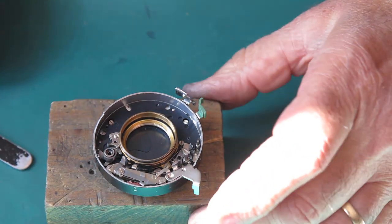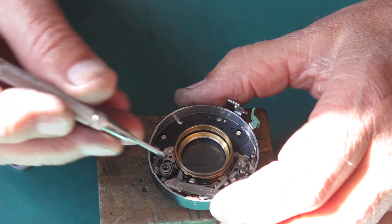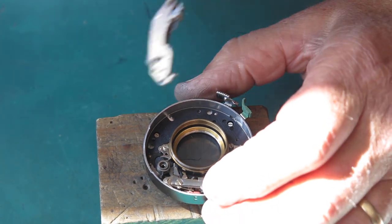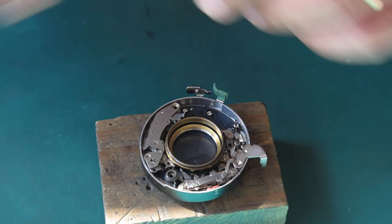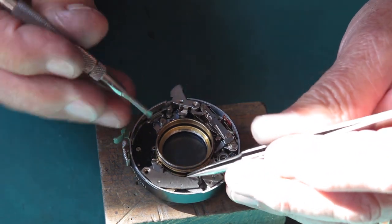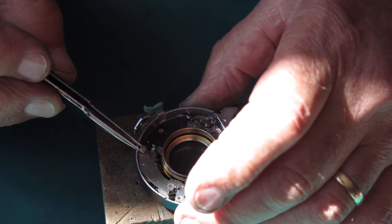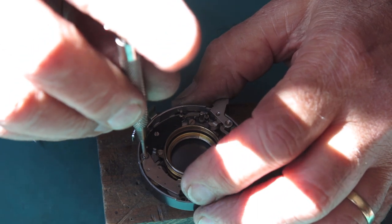That's working very nicely and it needs the speed trains put in next. Now I'm going to cock the shutter. Here's the retard gear train. The tab at this end of the retard gear train needs to be pulled back so that it drops behind the tab on the blade actuating ring — not on top of the tab, otherwise when you do this things will get bent and nothing will run right.